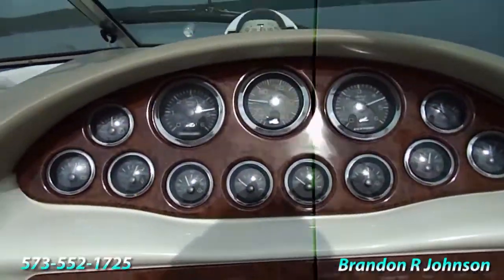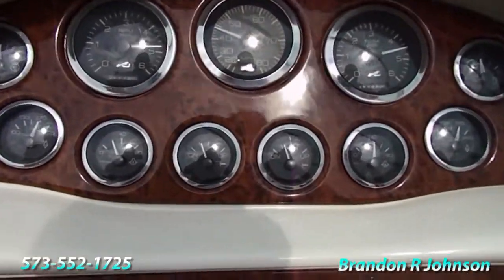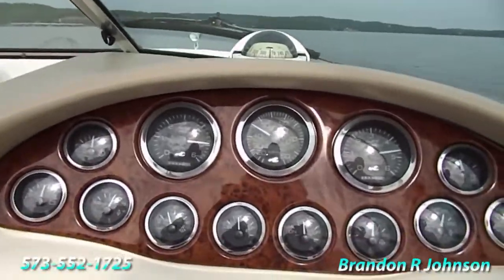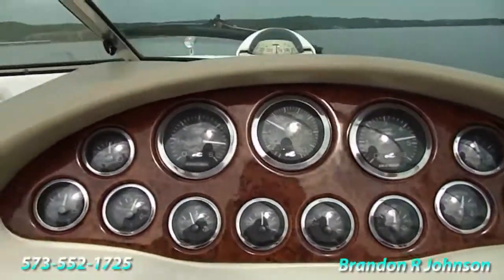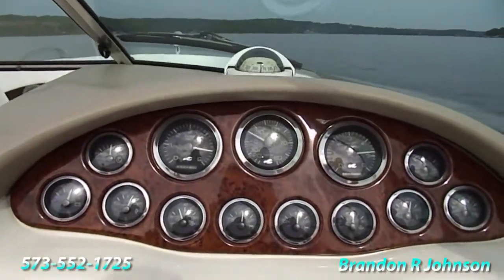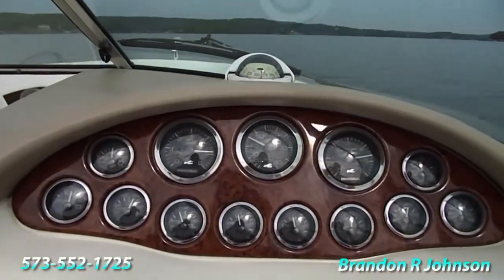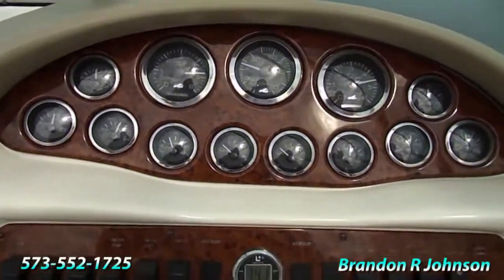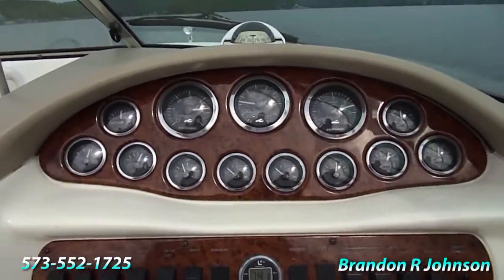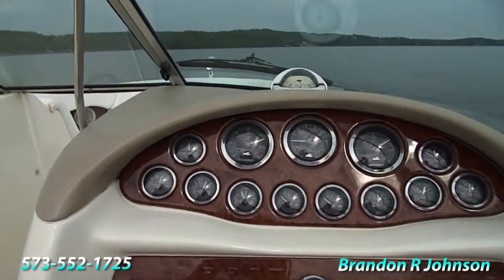All right, now let's go ahead and trim up. I'm bringing the outdrives up. See my gauges? See my speed increasing? So upper 40s is going to be our top end. Right there, around 4,800 to 5,000 RPM. So let's trim back down. Man, this thing runs strong.